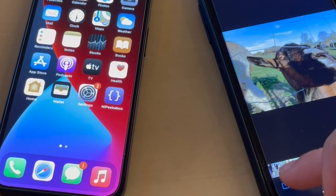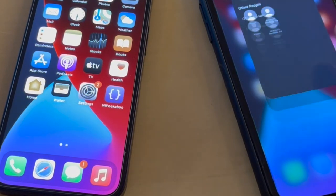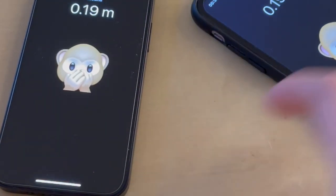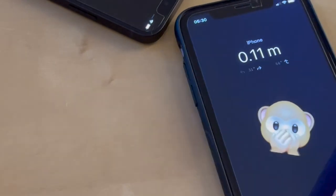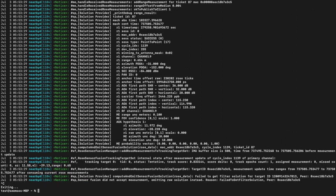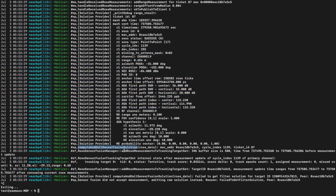The easiest option to start interaction with the U1 chip is using AirDrop. However, as long as the other device is not in the contact list, spatial information is not displayed in the UI. Instead, you can download the Peekaboo example application from Apple, which is much more helpful and shows distance as well as angle information. In contrast to AirDrop, it exchanges a peer token also used for the STS in the U1 chip. What you can see in the nearby daemon output is regular measurements from the ROSE chip, all sent to sensor fusion to get the actual values.